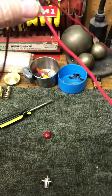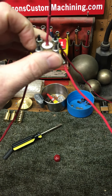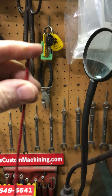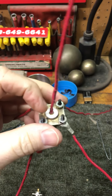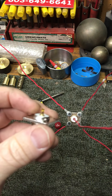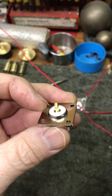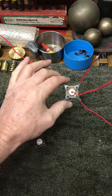The wire doesn't even have to be perfect — you can see it's got some kinks in it. Here's my antenna: what you'll need is an SO-239 connector like this — they're just a few bucks, you can get them online, Ham Radio Outlet has them. You'll need the SO-239 connector and five pieces of 19 and a quarter inch long, 14-gauge wire. Here, the top of my wire is 19 inches from the end down to the bottom where I have it soldered in. What you want to do is take your center conductor and skin the insulation back about three-eighths of an inch so it'll fit down into this center conductor here.